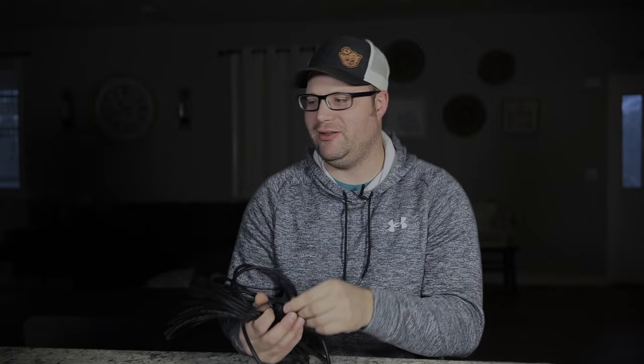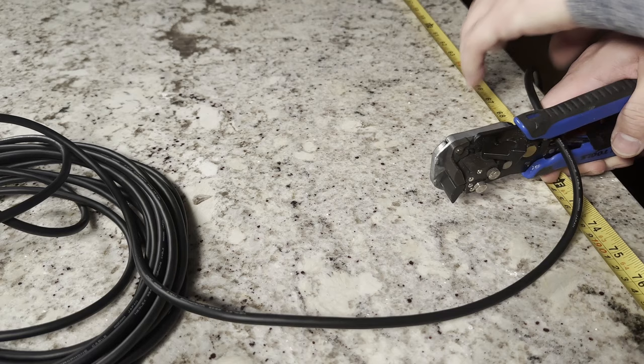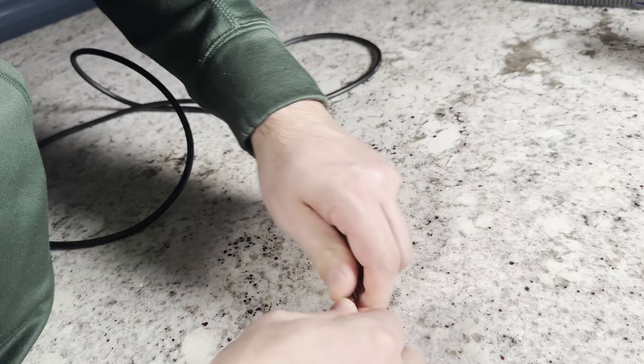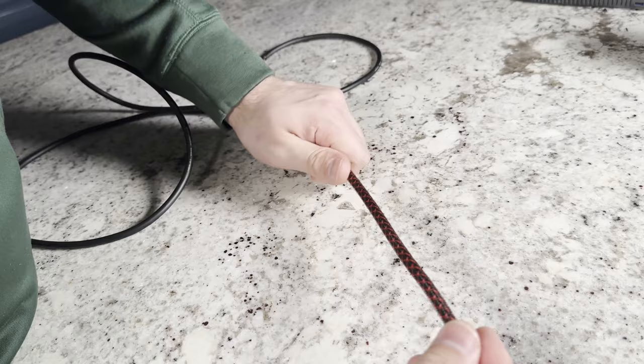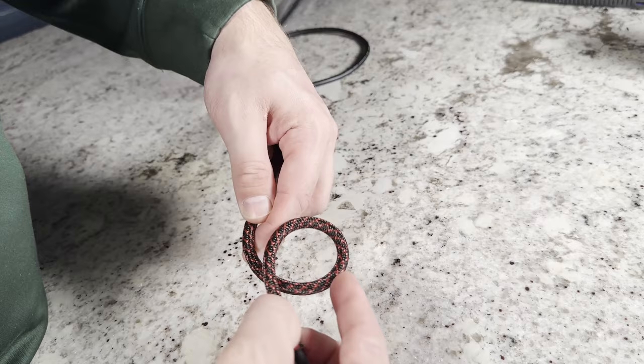All we have to do is figure out what length we want and cut the cable to size. For this demonstration I'm going to do a six-foot length, though you save a lot of money on long runs like subwoofer cables from the back of your home theater to the front. If you want to give your RCA cables a nice high-end look, you can use TechFlex - they make all different colors so you can match your equipment. I'm not using it today because my cable is a bit thicker, but there is a thinner cable that works well with it, and I'll link that in the description.